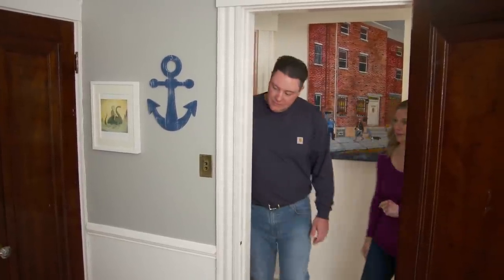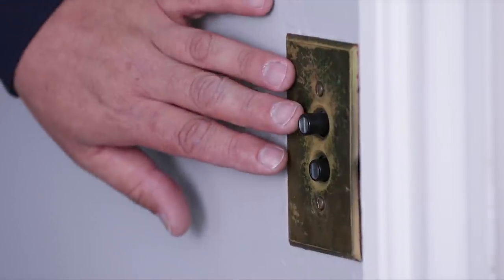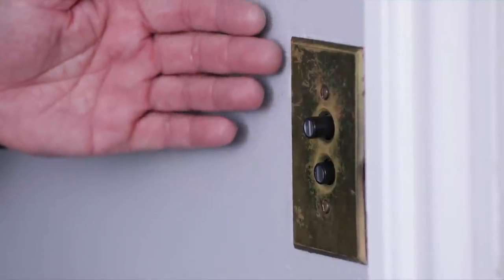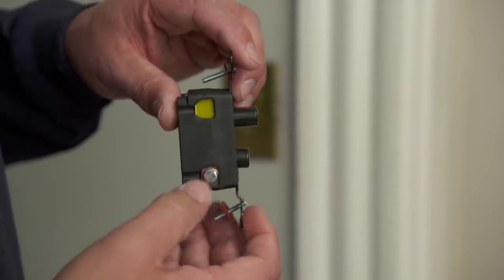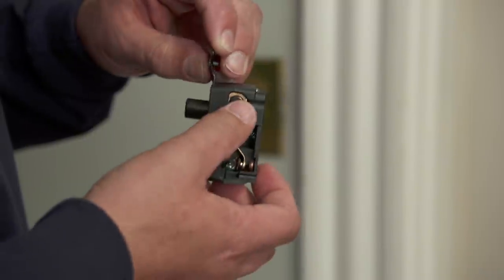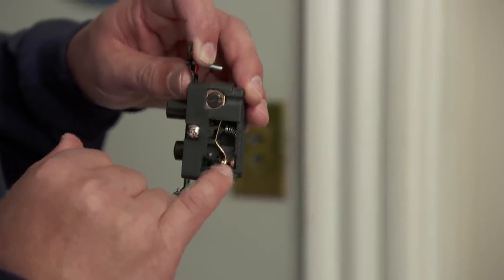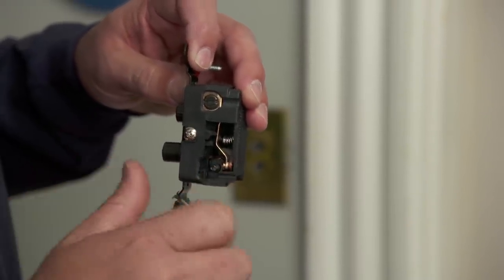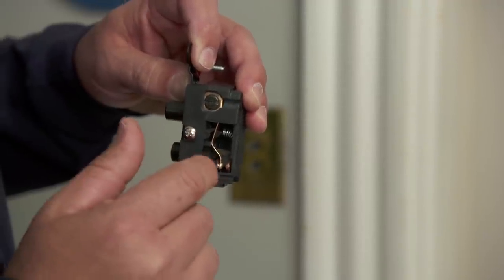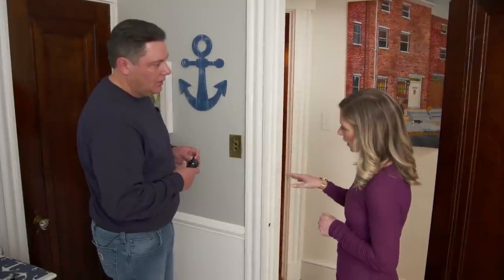So here's Wesley's room, and here's our light switch. These are beautiful switches — you don't see these too often anymore. They used to have these beautiful mother-of-pearl inlays and brass plates. Normally we'd send the power wire to one screw, the load wire — in this case the light fixture — to the other screw, and the ground on this one. If you look inside the switch where we cut it, you can see two tabs that are separate. When we turn the switch on, the two tabs make contact and let power go to the light fixture. When you turn it off, it breaks the tabs — no power to the light fixture. These are really beautiful — but why aren't they used anymore?